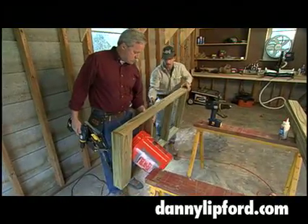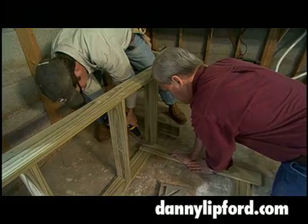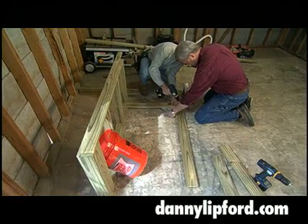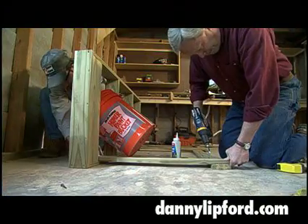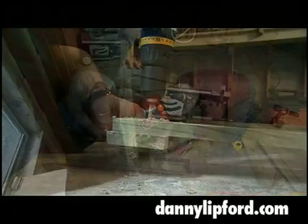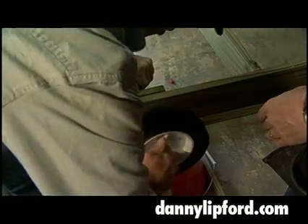The top half of the bench will be the frame we add on to to form the rest of the bench. By angling these 1-5/8 inch screws, we keep them from going all the way through the two 3/4 inch thick boards as we build up the bottom corners. The two front legs are a bit shorter because that's where we'll mount the wheels on a half inch steel rod that will serve as our axle.